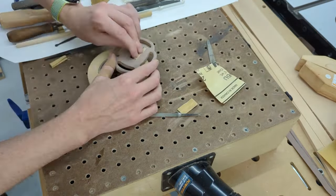And if you weren't sick of sanding just yet, here's some more for you. I cut a few thin strips of sandpaper to get into the decorative cutouts on the tsuba and enable me to mimic the roundover created by the router. Grit after grit, the tsuba is finally done. You might be able to sense how overjoyed I was to be finished with it. After the tsuba is finished, I slowly and painstakingly progress through the grits to achieve a buttery smooth finish on the sycamore blade and the walnut tsuka.